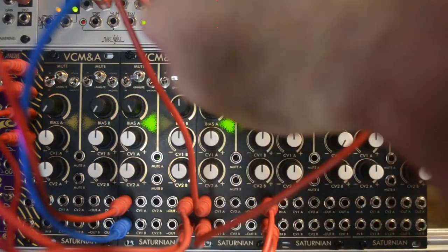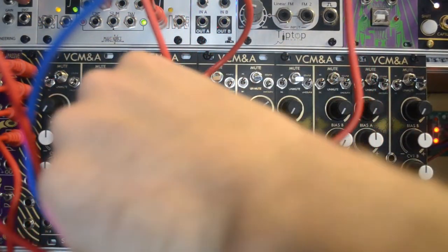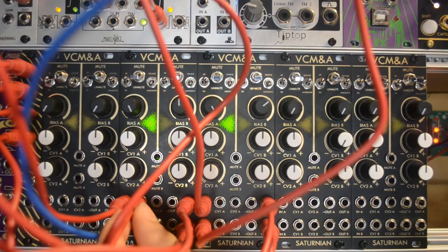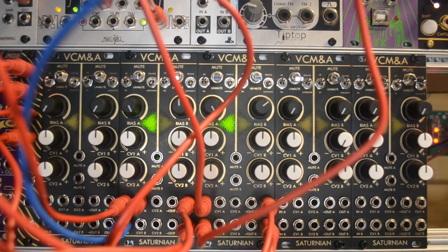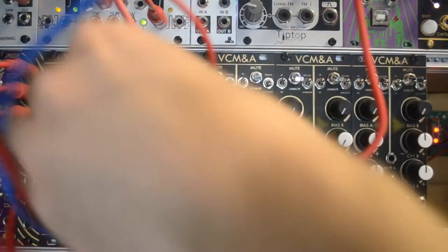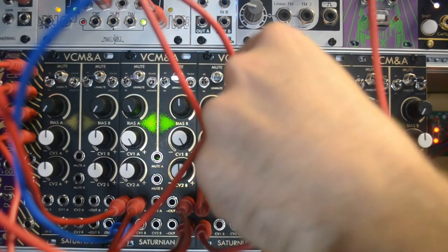If we wanted to control the amplitude of these four voices using the same signal, traditionally we would need an external buffered multiple module to make three copies of our CV. Here, however, we can simply put our CV into the earliest input in the chain, and it will get normaled down to the three other corresponding inputs, thereby controlling all four voices of our chord with only one CV input.